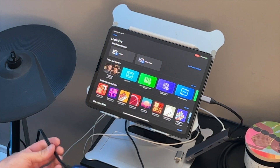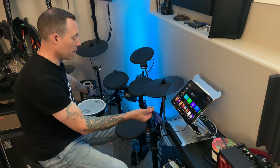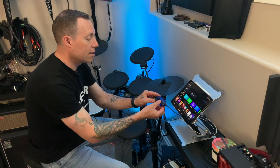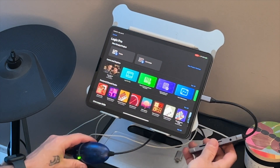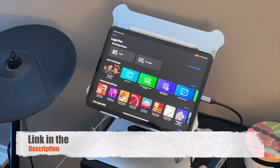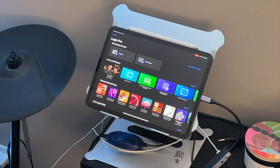Basically, what you want to do is connect a MIDI cable to the MIDI out on the Roland V-Drum module. The MIDI is sending out into this M-Audio MIDI Sport, which converts that into a USB cable. The USB is then plugged into this USB hub — I'll also leave a link in the description for that. The other white cable is my USB-C charging cable, keeping the iPad charged while I work.